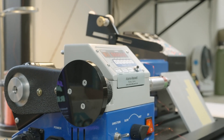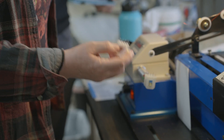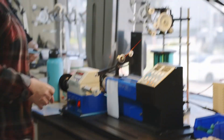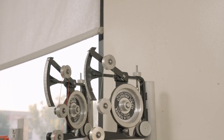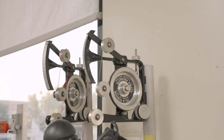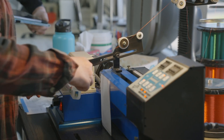What we do is we've got a piece of paper with its winding diagram. This transformer is very simple — it declares 750 turns of whatever gauge wire that is. They load it up onto this tensioner and bobbin here, and pull the wire on, onto the bobbin. It's going to attach the first winding, starting at pin 1 and ending at pin 5.